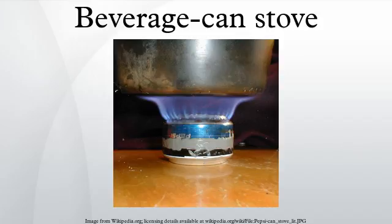Standard: the classic ultra-lightweight backpacking stove, designed for one person, lighter than commercial models of the same design. Inverted two-piece: smaller and lighter than the standard version, but difficult to fill. Side burner: doubles as its own pot stand; a tight fitting pot can increase fuel pressure. Pressurized: a more powerful version, but heavier and more difficult to make. The stove is sealed with a thumb screw after filling with fuel, which allows the stove to control the rate of heat output. An additional base is used to hold fuel for preheating.